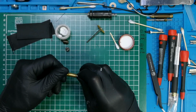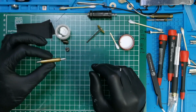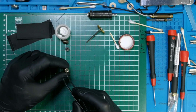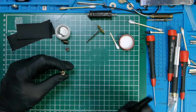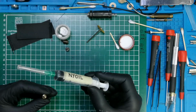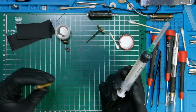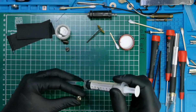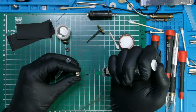Now this sound is the lack of lubrication. What's important to lubricate in case of these rollers is this point, so where the shaft exits the actual casing, and that point. And you can use either shutter oil, pretty much any oil, but it has to be something very light. But I suppose modern oils are all better than whatever the Soviets used, so it doesn't matter that much in these cameras. I wouldn't use anything on a Leica, for instance.